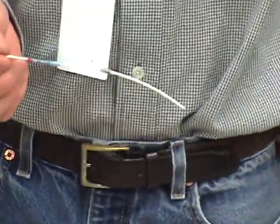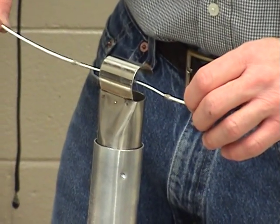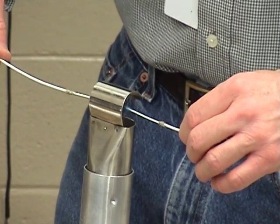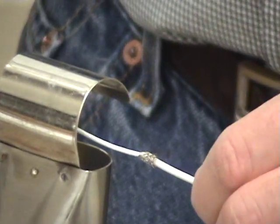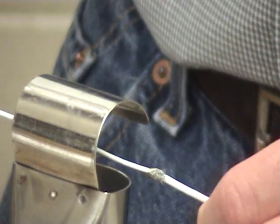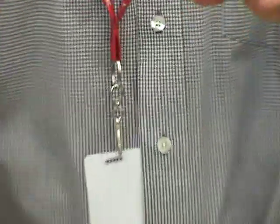What I need to do now is shrink that up before I slide my shielding over the top. I'm going to shrink this. I'm watching for the gel to start coming out the end — slowly shrinking it. It's starting to ooze — and that's a winner. Remember, I don't want my heating element to burn up, so I've got to go to cold. Set it to the side and let it cool off. Now I'm ready for my sleeve.